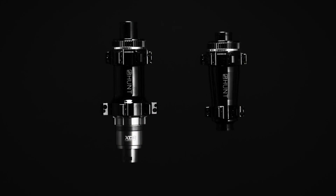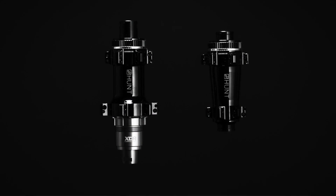We then put them through a T6 heat treatment, which improves the grain size to make a stronger metal. We then machine them, anodise them, and then machine them again to make sure we get the bearing faces to the required tolerances.